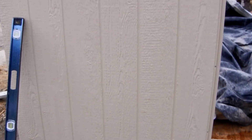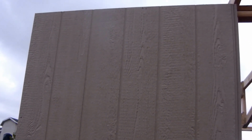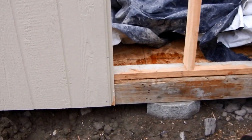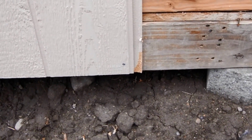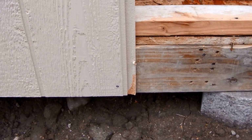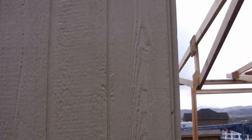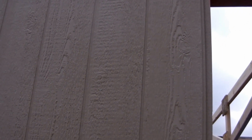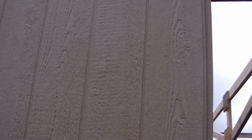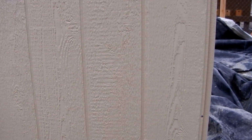Okay, I'm hanging siding, so I thought I'd stop and take a little video. So I wanted it to fit perfectly for an 8-foot piece, and I came really close. I thought my floor was going to be 6 inches high, but as it turns out, it's 6 1/4 because of the 3/4 inch floor and a 5.5 inch board. So anyway, I'd done 8 foot minus 6 minus 4.5 for the bottom plate and the top plate. So I'm about 1/4 off, which is fine. I'm gonna hang it low and then cover that top when I put a facing on or fascia.